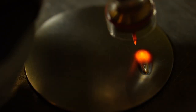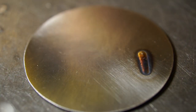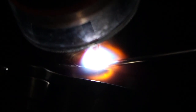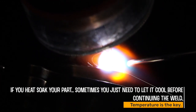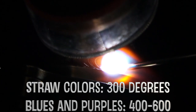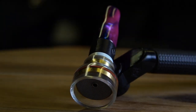The typical rule for steel is one amp per one thousandth of material thickness. This tube is 0.0625 inches or 1.6 millimeters thick, so you'd use about 60 amps — right? Wrong. Stainless and titanium among other alloys don't always allow for that rule; they don't require as much heat, so you can get away with less amperage. I weld this tube at 45 to 50 amps for full penetration. My machine is set to 65 amps for easily wetting out my toes and penetrating when the tube is cold. Post flow is the magic ingredient to complete our recipe — it must be long enough to shield the weld while the base material cools to the desired temperature. Straw colors oxidize around 300 degrees, and purples and blues occur in the 400 to 600 degree range.